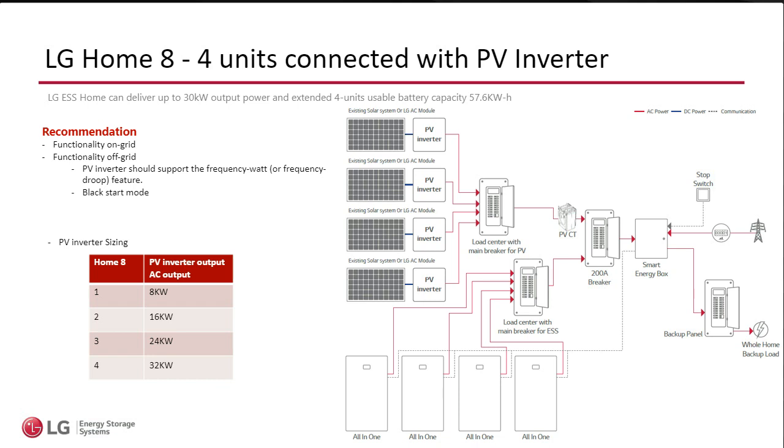because we know that all of these smart inverters must, by regulation of UL 1741 and IEEE 1547, react to changes to the frequency. As the frequency is moving up, they start throttling back. So when we move the frequency from 60 hertz up, then the PV inverters will scale back down. And we can actually shut them off completely. The frequency will get to 62.5, and all of the PV inverters must turn off.